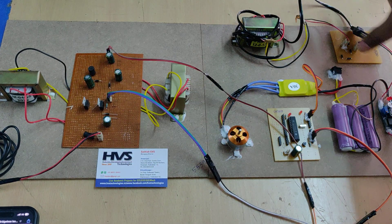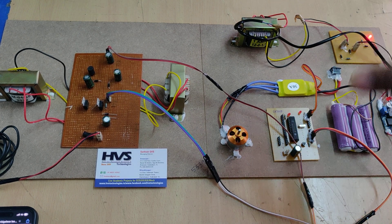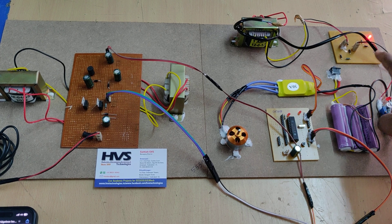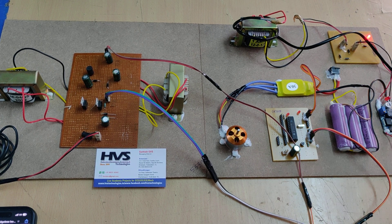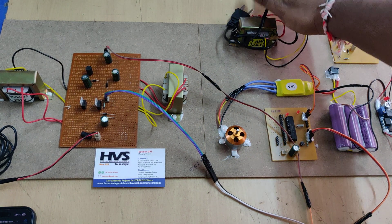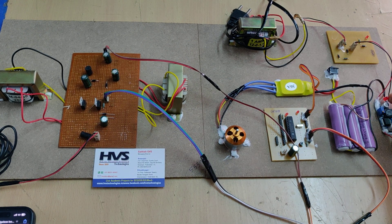This is a bridgeless converter and the backup is a bridge converter. The secondary source of battery charging circuit is not part of the main project — it is only for safety. When you turn on this charger, keep it on for a minimum of 2 hours, maximum 4 hours. For our project demonstration, 2 hours of charging is sufficient. Once the cycle completes, the bridge converter output will show LED indication here as well.